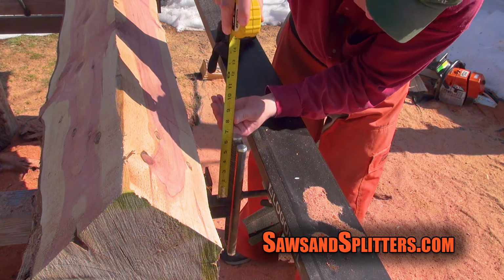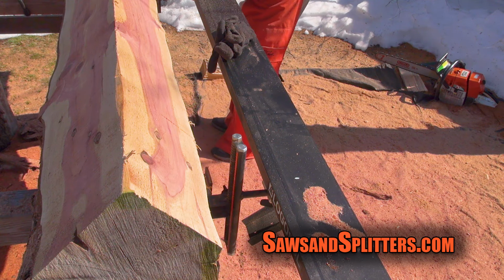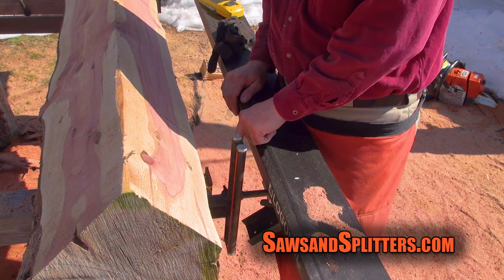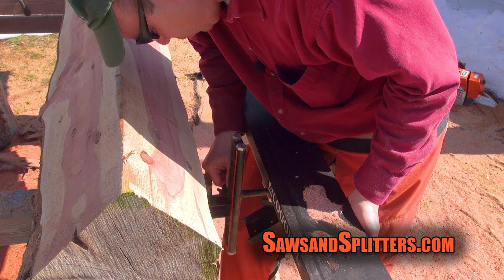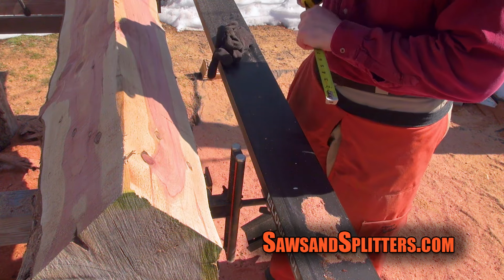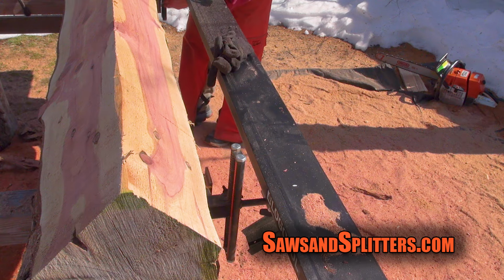So if we check the height, we are at 7 inches, as opposed to the last cut we made when we were at 10 inches. So clearly I need to learn math, because at 1/4 inch per click, that's only 3 inches. So I really need to go down another 4 clicks. Take the tension off, and then 1, 2, that's 3.5, 3, 4. So it was 7, so now it should be like 6, right? So now it's at 6, and the other side was at 10. So now I just got to get this side down to 6 as well. Okay, we got this side at 6.